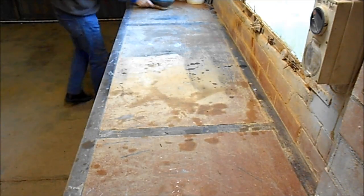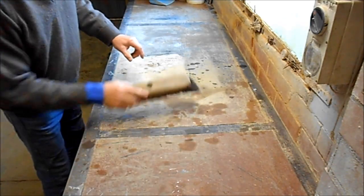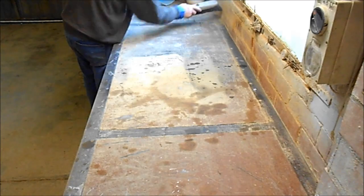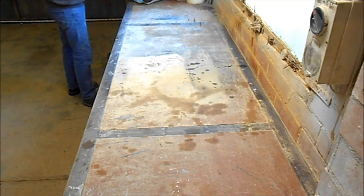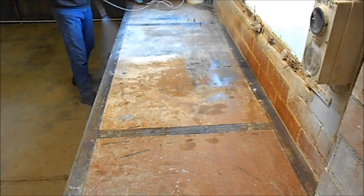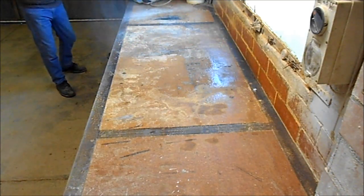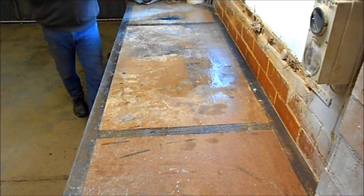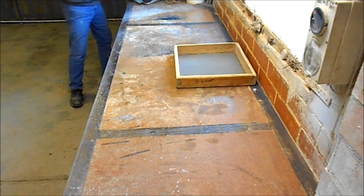Now that we have our sand ground, we need to temper it with water so that we can actually use it to make a mould. Because I'm a bit fussy with this facing sand, I like to sweep the bench down to get rid of any little bits of rubbish that might have accumulated. Some people often ask how much water they should add to their sand — unfortunately there is no certain sure answer. Different sands require different water. This sand is a natural sand and as such it's got quite a high clay level, which means it will require quite a lot of water.